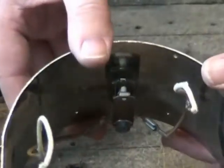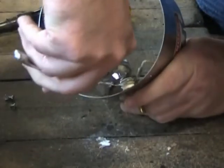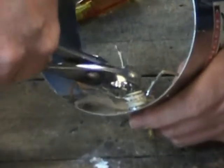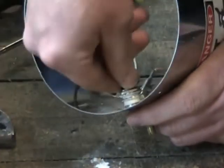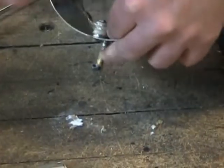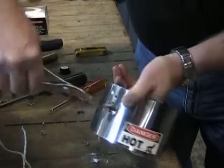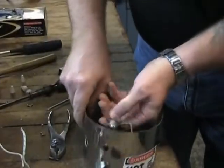The head of the mounting bolt has been ground down at the factory, so you will need to loosen the nut located on the inside of the casing in order to remove the old thermostat. This can be accomplished using either a wrench or a standard pair of pliers. The harsh operating environment along with extreme heating and cooling over time may cause the mounting bolt to become seized in the thermostat assembly, making it a little more difficult to remove. With the bolt out, the thermostat is easily removed from the solder pot casing.